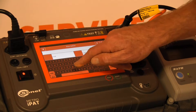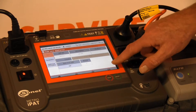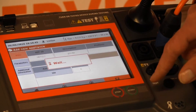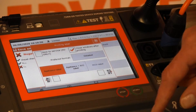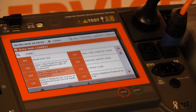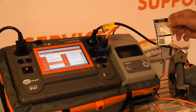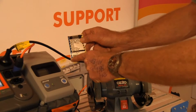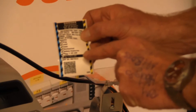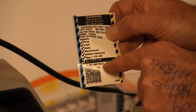We enter the type mark and put 'grinder GR', then hit the print icon and select appliance label. This time you will see the label is different from previously — it says 'Danger' and you'll see the different serrated, angled lines around the edge. It also highlights what the fault is.